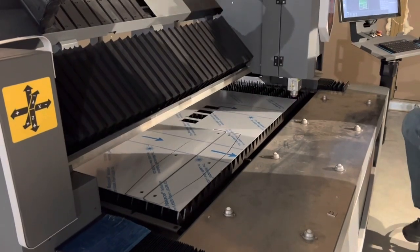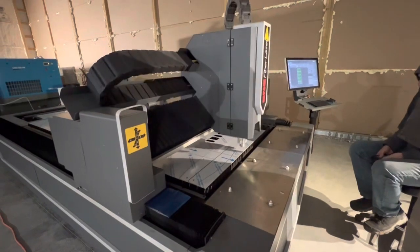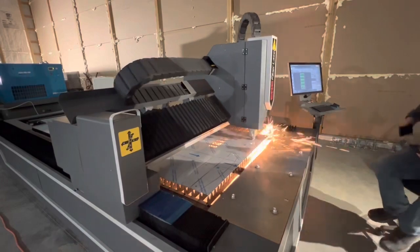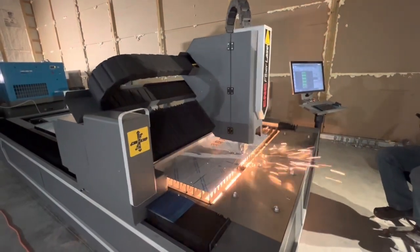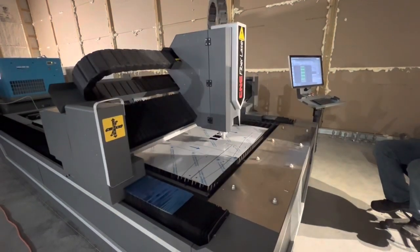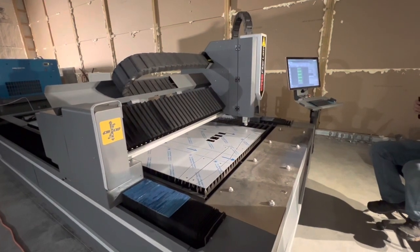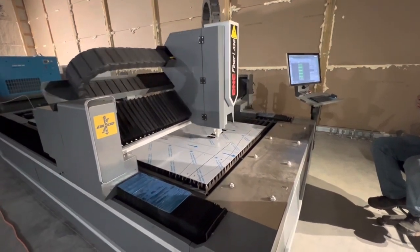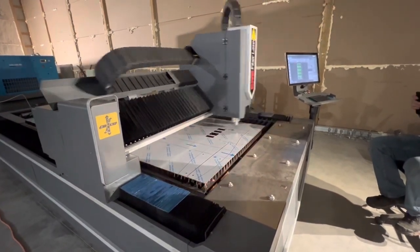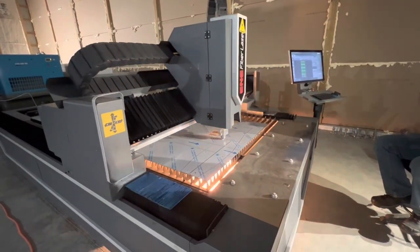You'll notice the canted gantry in the video — it's on a 45-degree angle. Not just the gantry, but the bayonet up top where the cables and fiber cable route into the head are all on an angle. One critical thing about moving a machine this fast is the whip of the bayonet and the cable track. If it's not on this angle, it can start whipping around, and at the end of the fiber cable where it enters the head, it can come loose and get dust inside, causing major problems.